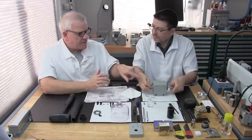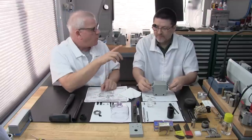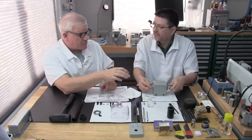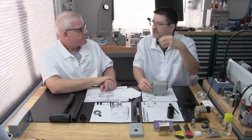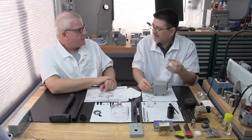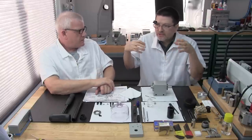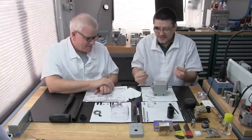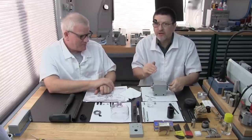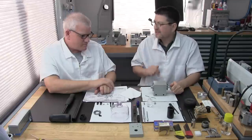Even though it doesn't have the slinger on it or the locking nut yet, what he's saying is those things can all be fixed. As long as you have this scenario done with your locking pin and everything, you got it. Once your spindle nut is fastened and tightened, that means all the bearings have the preload on them and the whole assembly is tightened up. So this is where, if you're going to get any type of binding, you're definitely going to see it at this stage.